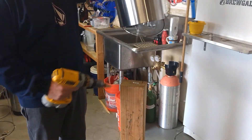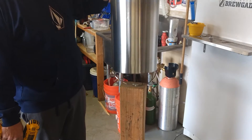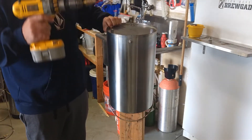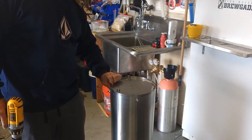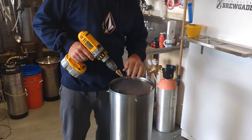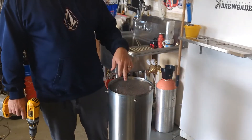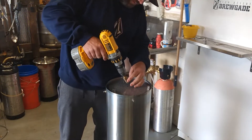I put a piece of wood underneath it. The main reason is that as you drill through the fairly thin sheet metal, I didn't want it to balloon out on the backside and rip or tear the metal. It also makes it easy to hold up for the video. I'd advise some sort of metal or wood to drill into — this holds it nice and high and I just had this piece laying around.